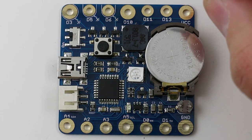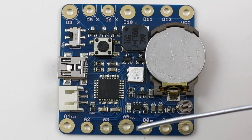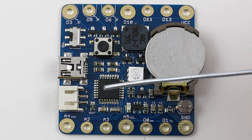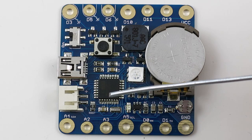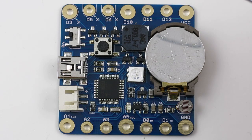This new version has eight digital pins and four analog pins. It has an ATmega328 microcontroller running at 3.3 volts and 12 megahertz. Unlike the standard Arduino, it does not have a separate USB serial chip. Instead, it simulates USB functionality in software by using the vUSB library.